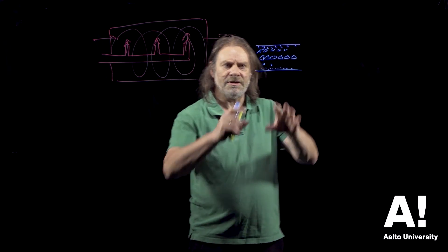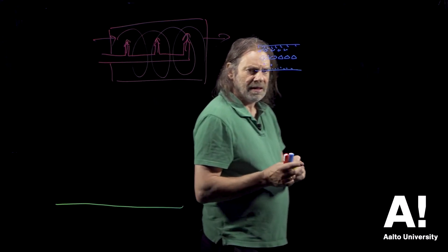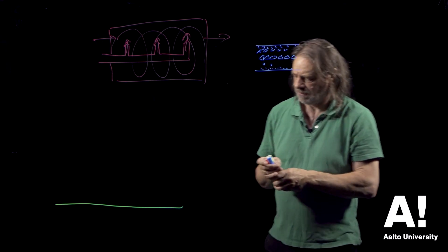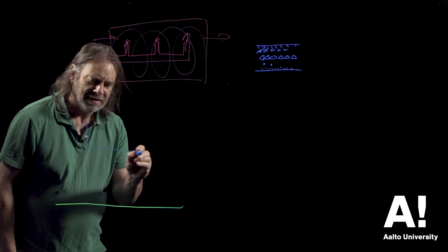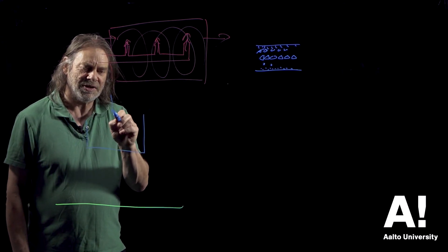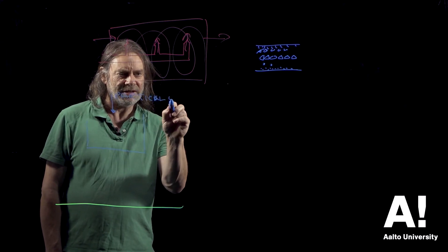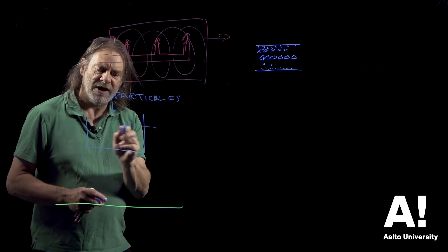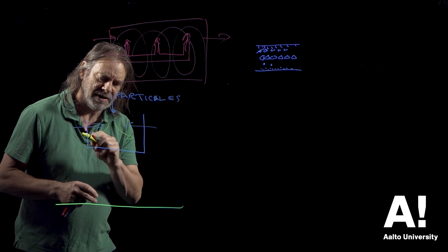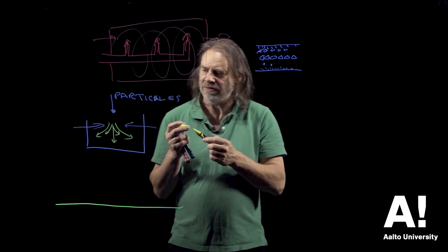So how do we get this spread? When producing on a sheet of metal, we want to get this layered structure onto that piece of metal. What we do is have the particles dropping into some sort of bin device, with an air flow coming in to agitate them. The idea is that the small particles, because of the agitation, will go on the outside; the medium-sized ones will go in the middle; and the big ones will just drop straight down.